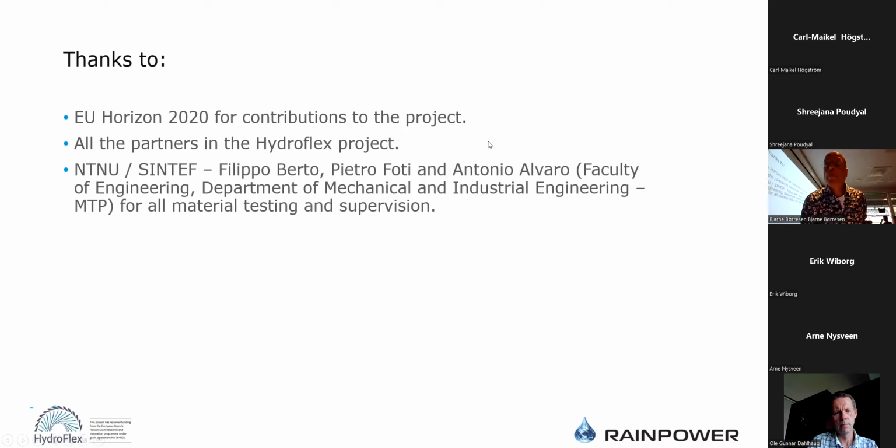We think that with all of this work, all the measurements we have done on the prototypes in recent years, and our new and better computer models, we are now more able to predict the resonance frequencies in the units. Because it will change when you add the runner in water and put it in operation with the narrow gaps, with the seals and everything. It's different than just predicting in here. So we have better tools these days.